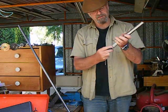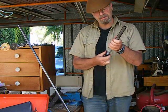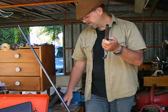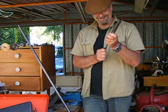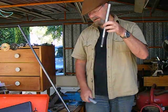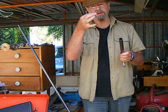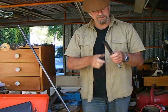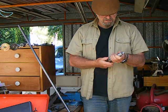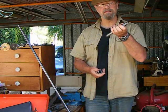I've thought of all sorts of fancy ways — in fact I've drilled holes out of the sleeve and put threads in them so you can put bolts in there to screw the two dogs back in once you've got the locking tang out. Let me show you the spring mechanism. Take the locking dog out, take the sleeve off. I just get a bit of 6mm wire and bend it into shape — you can probably do it a little bit better than me, this is a prototype remember. Just put it in there like that, press the locking dog in, and now she comes. That's it.